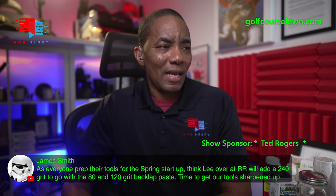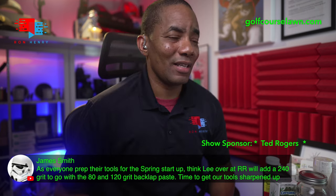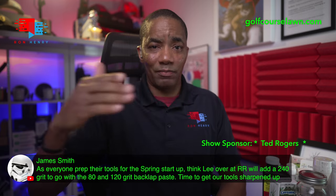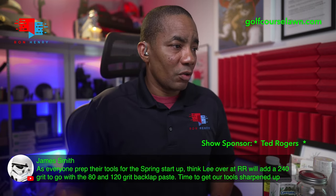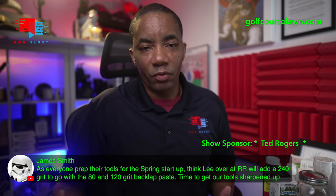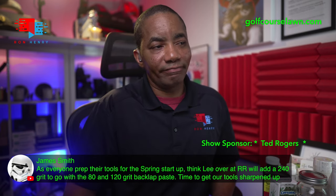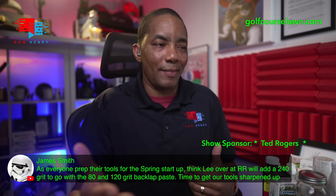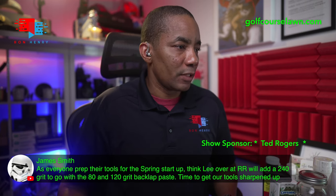240 grit, man, I guess you can really refine the edge you get, but that's going to take a while to backlap using that. I guess you would go to 80, then 120, and then step it to the 240. That's going to be interesting. If you get the 240, James, Robert will probably get the 240, knowing him. It'll be interesting to see if there's a noticeable difference in sharpness. In other words, if the juice is worth the squeeze from a standpoint of the additional time it takes to backlap at 240 grit versus something a bit more coarse like 80 or 120. So keep me posted.